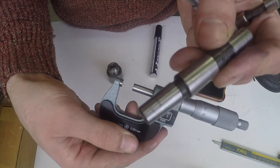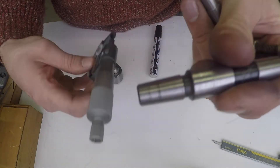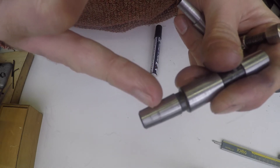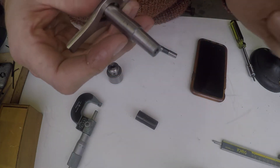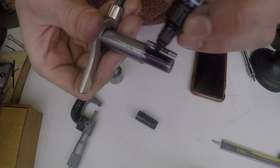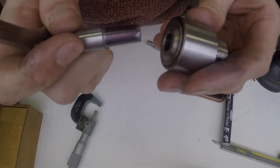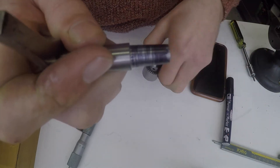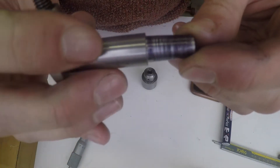I was actually using the taper that came with the Jacobs chuck as a gauge, but it's actually not machined very precisely — it's quite undersized, then quite oversized, and there's quite an obvious area where the taper is binding, shown by these two marks in the material. We'll do a test of this one as it is, machined to spec — mark it with some bluing, put it into the chuck itself, and see where the taper is engaging. We're getting really good engagement for quite a large portion of the taper — I think that's going to be good.